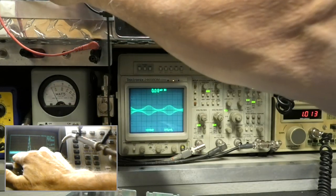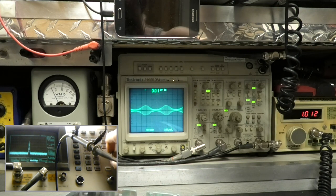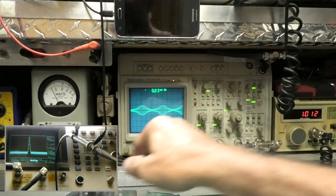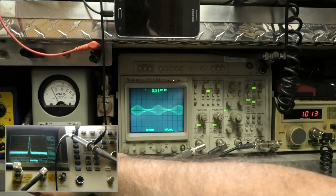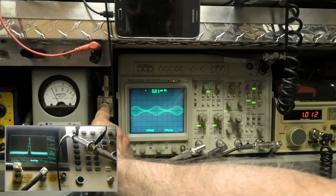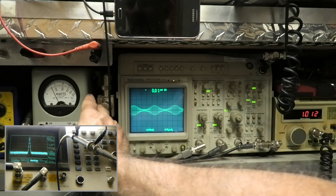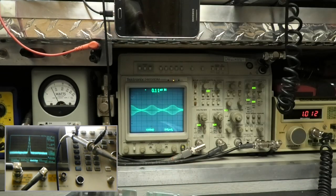Nothing. Well, you see it a little bit, but 40 dB of it has been attenuated. It's all gone. It's history. You can't see it. It's consumed in the meter. This is a 30 megahertz plug. It'll go up to 25 to 60. And that's a 30 megahertz attenuator with 40 dB attenuation. So it's not there, you don't see it.